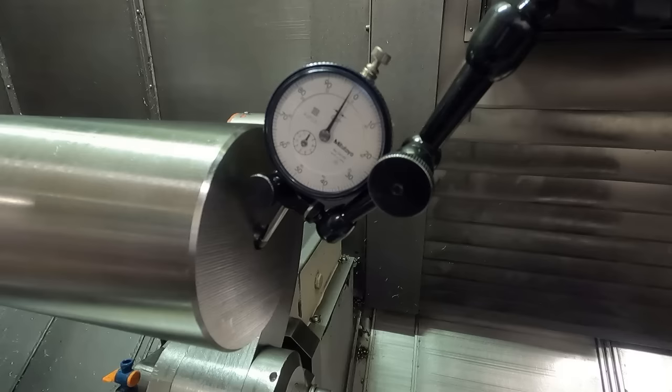You can indicate stuff with milling tools and things like that, but as far as lathe tools, you have to be kind of careful because most lathe tools have offsets in two different directions, one for the length and one for the distance the tool is off center. And if you're looking at your display and thinking you're at the X and Y center, you really aren't, because it has the offset in the X direction.